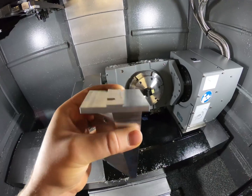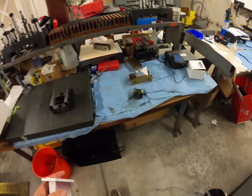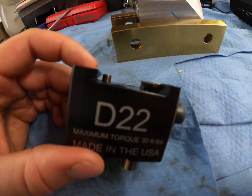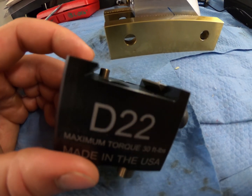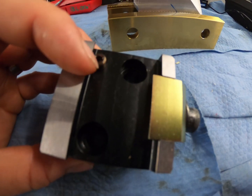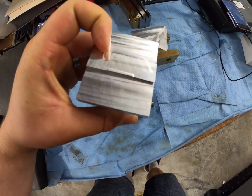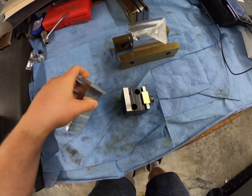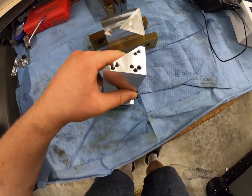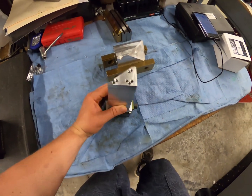I definitely recommend going a size up if you're going to be doing anything like this. We actually got the next size up, which is the D22, and it's got a way bigger dovetail — I think the D115 is like 80 thou and this is 150 thou, so you can hold a lot better. It's also pretty cool — you've got this little locating pin here, so you can machine a slot a few tenths bigger than the pin. We went about five tenths bigger, so when you put this on it drops in and now you're located in both directions. That's really powerful.